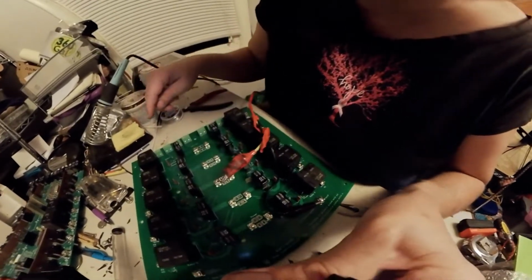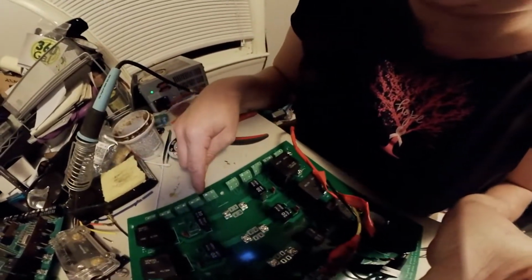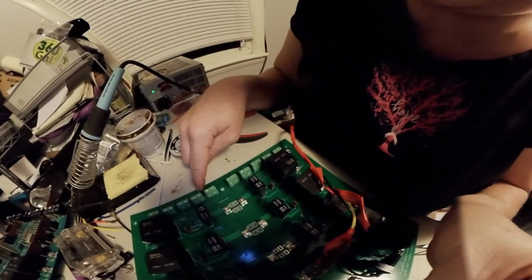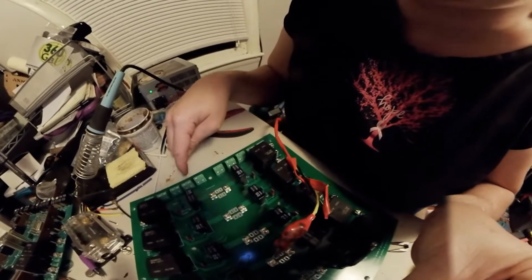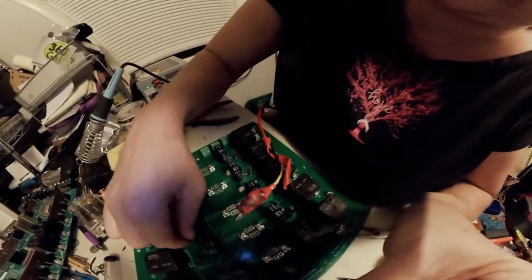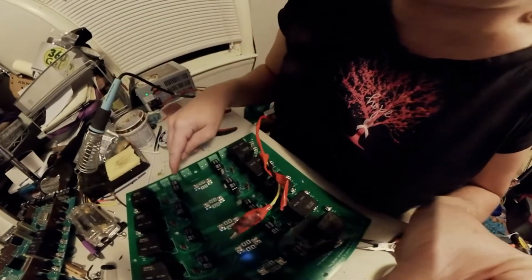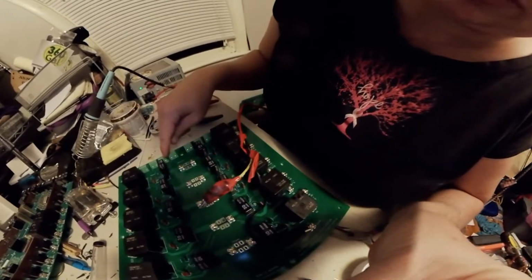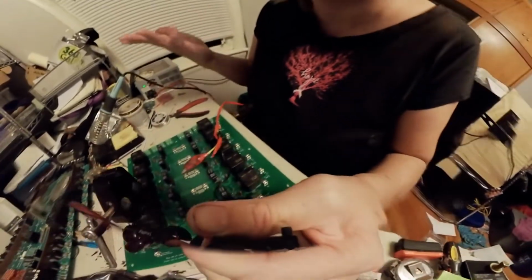And you would come up here to coil, this number 4. Come up to coil 4, and being that that would be hot switch, you would feed it into the positive side here. If you want to do the ground switch, you feed it into the negative side there. And if you want to make either-or switch, you put both of these in the down position, which allows you to control the relay completely outside of the board. So I'm going to mess with these other ones, see if I can get them working right, and I will see you guys a little later.